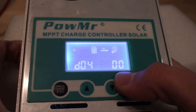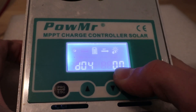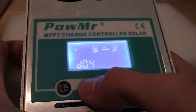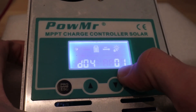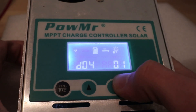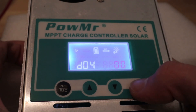D04 is going to be your charging mode. Zero would be lead acid or AGM — that's going to have the three modes where it goes from bulk to absorption and over to float. If we go up to one, that gives us CCCV: constant current and then constant voltage. That's a two-step charging profile, and that would be for your lithium batteries. For this scenario, we're going to be doing zero.